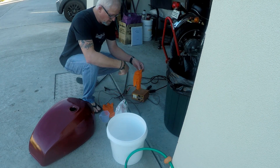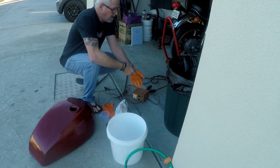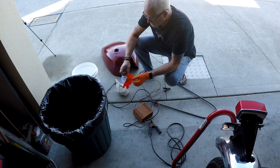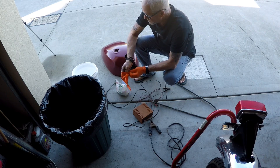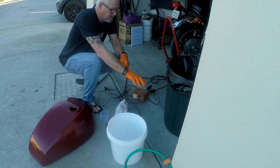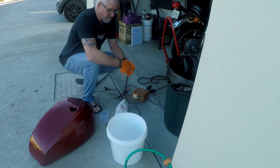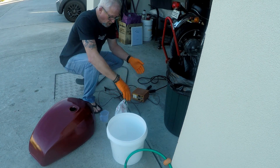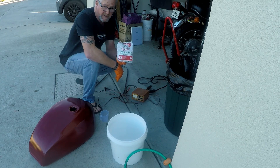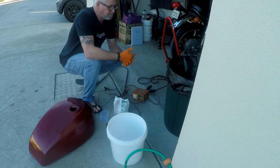Hopefully I've got everything I need here — it's not very difficult. What I've got is a large 75-litre bin with a bin liner in it. You don't need to do that; I just did it because I want to reuse it. It needs to be insulated — whatever you use, it needs to be plastic or something that won't conduct electricity, it needs to be an insulator. I have got some washing powder — this is sodium carbonate. Not to be confused with baking powder, which is sodium bicarbonate. You just want the sodium carbonate.